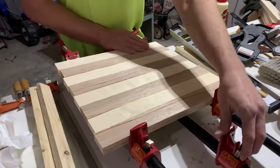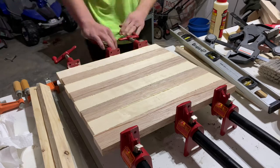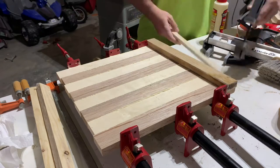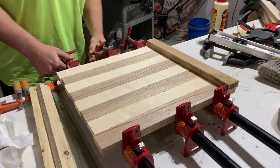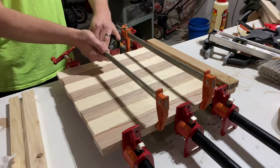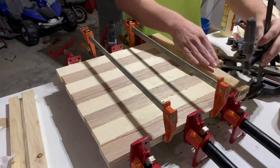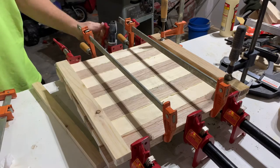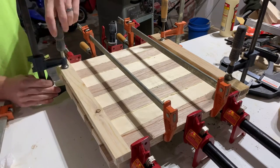Assuming you left your strips of wood a little bit on the long side, they don't need to be perfectly flush with one another, but it's still nice to get them as close as you can — waste not, want not. The pipes on my pipe clamps were so long that I actually had to clamp them down to keep them from tipping over — clamping a clamp, how perverse. I highly recommend some sort of clamping cauls as you're gluing up your project just to keep all the ends of the wood aligned. Just remember to cover the cauls with some sort of nonstick coating — I like packing tape — otherwise you're going to find yourself in a bit of a sticky situation. The more clamps the better, just don't go so tight as to take your project out of alignment.